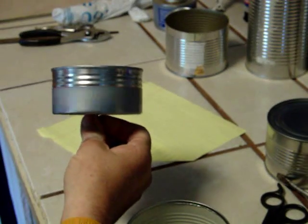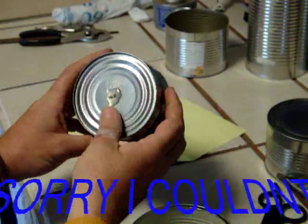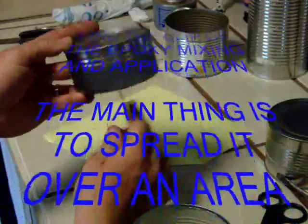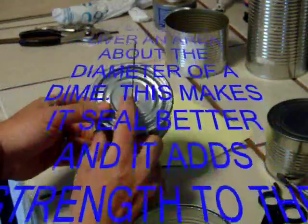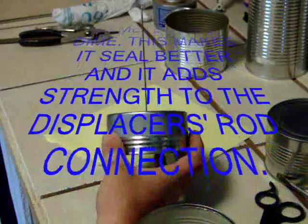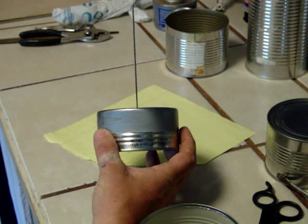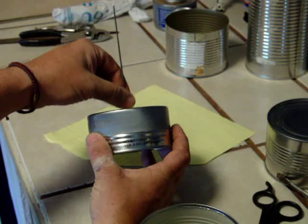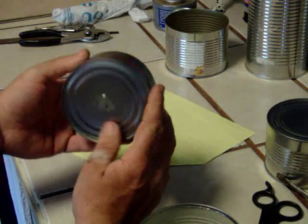Okay, hello. I'm Scott Brown with Green Wind and Other Home Energies. The epoxy here completely covers — I'll show you a few light angles because I can't see the same direction as the camera. Make sure you can see: notice this comes up a little bit, but if we look straight across the top, none of it comes up past the stick. If it does, take something to scrape it down, and try not to scrape the rod — you don't want to create friction in your seal.